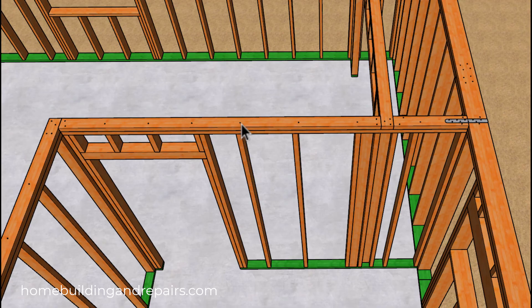I've never found an exact code for a nailing pattern. We used to just put our nails about 16 inches on center and use one nail, then one nail in the center for two by fours, and then two nails for two by sixes. You'll see a pattern of that here in a little bit.